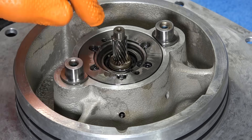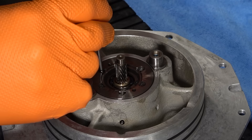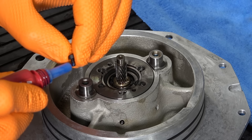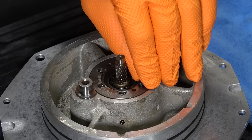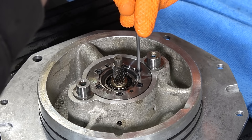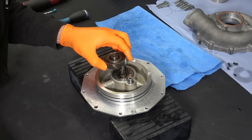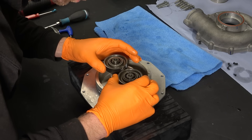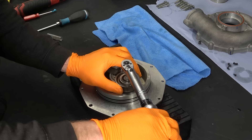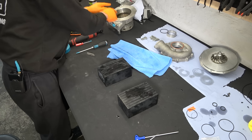No force on the shaft or the ring — just went in smoothly. Removing these two screws to apply Loctite, then reinstalling with brand new screws and medium Loctite. Snug them all up, feeling when the bolt comes to the end of its travel. Now putting back the helical gears with brand new fasteners and blue Loctite — torqued to 7 Newton meters.